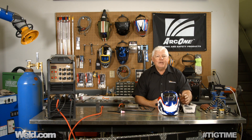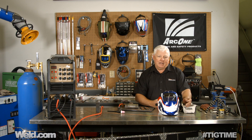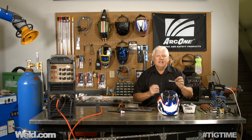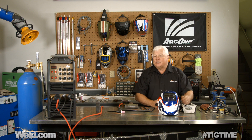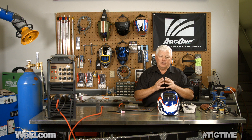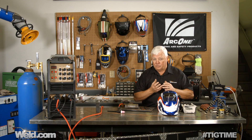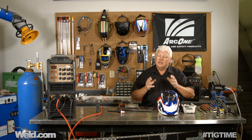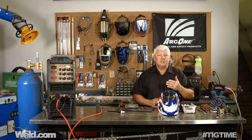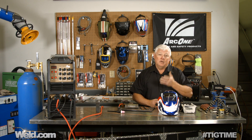The question that comes up frequently is about the technique we use for dabbing — and you'll see that almost all the welding I do uses the dab technique. It's not the only technique though. Dabbing is a very good general technique; it's good for general fabrication and it's almost exclusive to all aerospace. Every once in a while you'll hear somebody talk about a second pass, like a root pass and then a second pass, and it may have weaving to it. So we're going to demonstrate that weaving — why and when you would use it.